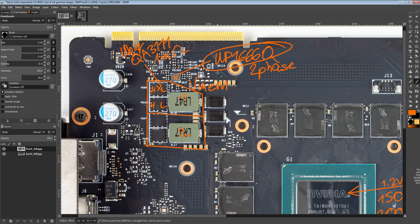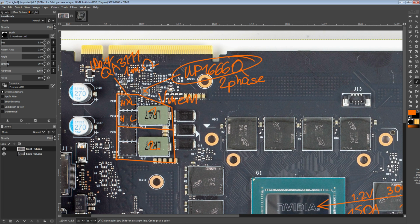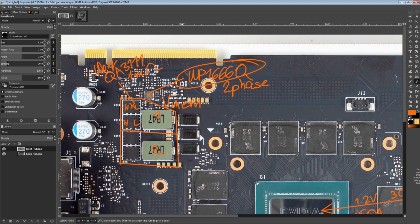But ultimately one that doesn't really matter. It's just kind of, oh yeah, these MOSFETs are different and they're kind of worse. Actually, not kind of worse, they're just straight up worse. Unless, well, you don't buy a dual NFET to just hold the low side turned on all the time. So that's not really a valid use case. In that case, you'd buy a low RDS(on) single MOSFET.